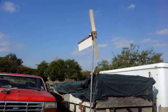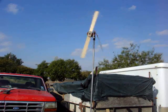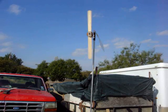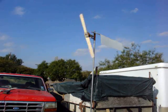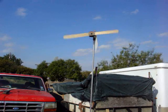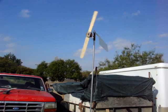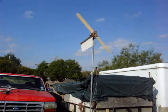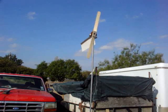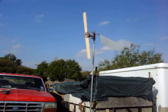Hello, I'm Scott Brown with Green Wind and Other Home Energies. We're looking at about 13 miles an hour. This is a Kluggy 619 treadmill motor with one of the props I carved, freewheeling right now. There went 17 miles per hour wind, back down to about 7 and 8, staying around 10. They're relatively quiet below 10 miles an hour, but get up into higher wind and you start hearing them a lot more.